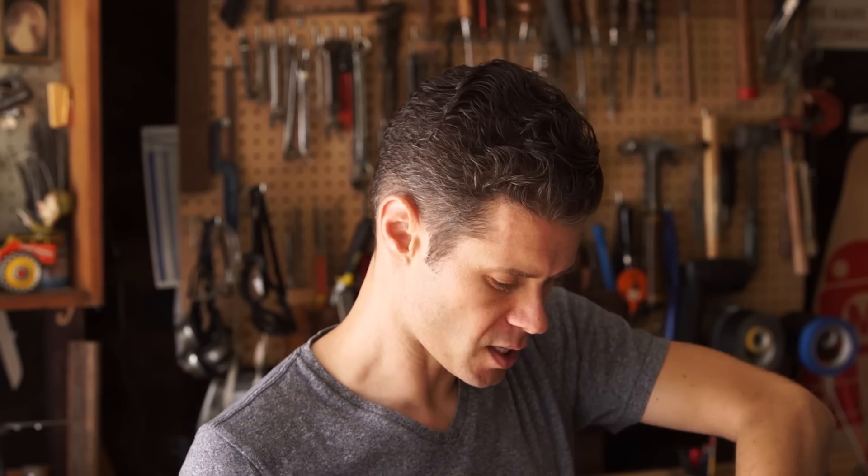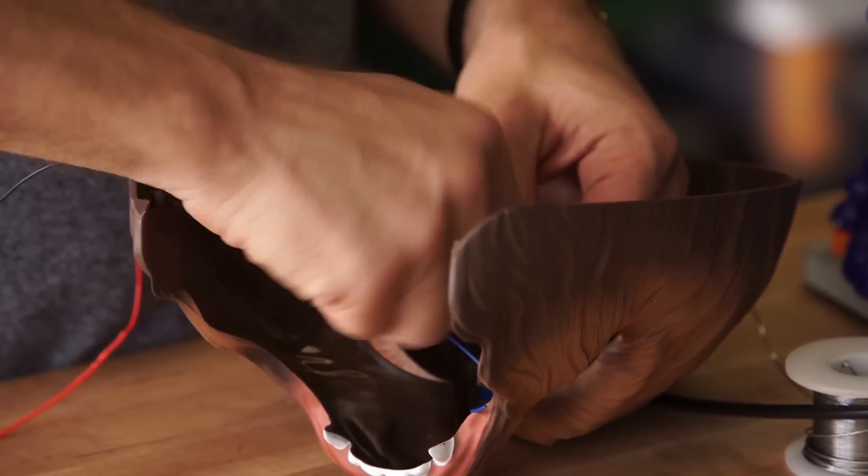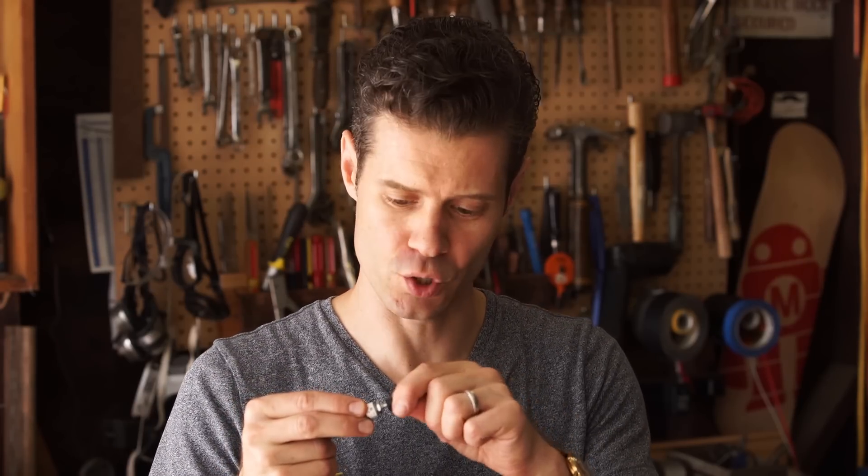Okay, we're done building the circuit so now it's time to attach it to Chewbacca's face. We're going to tin the speaker wires and solder them into the audio amplifier circuit. The next thing we're going to do is wire up our rotary selector switch. The way this works is that the center post of the switch will be connected to the momentary switch on Chewbacca's jaw, and all of the other solder lugs will be connected to the audio effects board. That means when we rotate the switch to say position two, all of the audio files named for position two will be triggered.